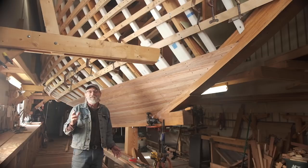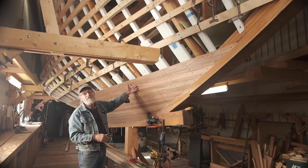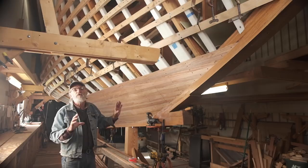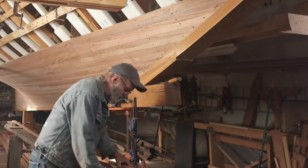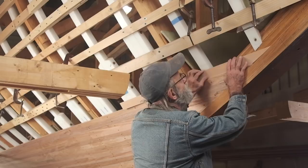To a professional eye, maybe the ribbands aren't on in the direction that they should be. But for our purposes it works out perfectly because we've put the ribbands on congruent with the shear — parallel to the shear, equidistant from the shear. The idea is that the ribbands would parallel the strip planking. The strip planking is congruent, parallel, or equidistant from the shear. And the planking we put over the top of it will not be put on that way — it will be slightly biased to this. First thing I'm going to do is take a little template, just a piece of quarter-inch plywood, and put it in place as if it's a strip plank.